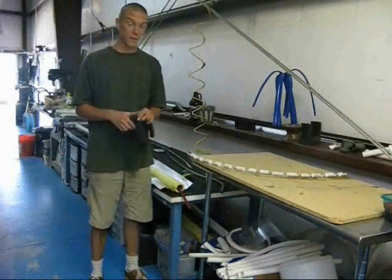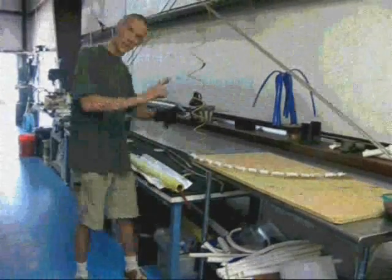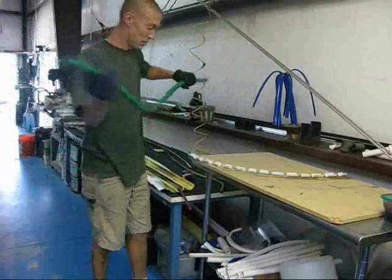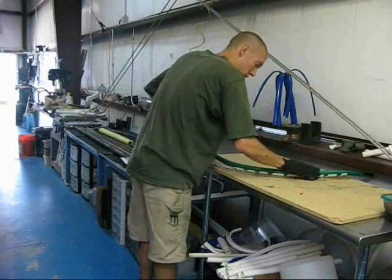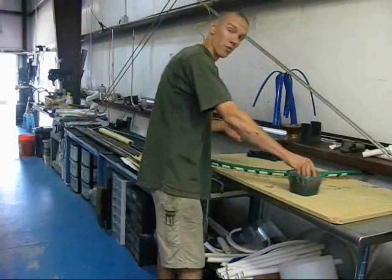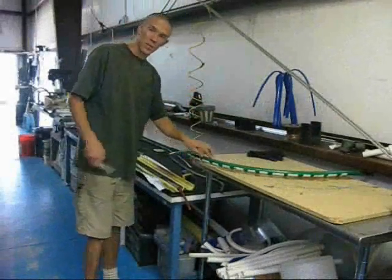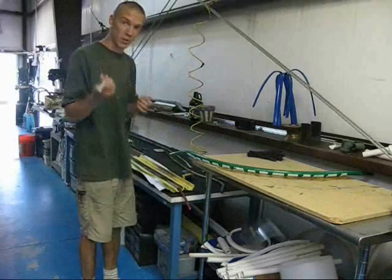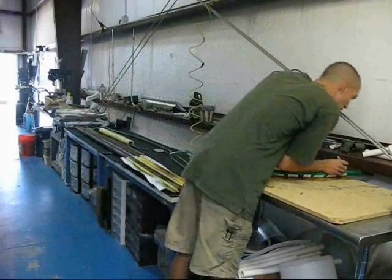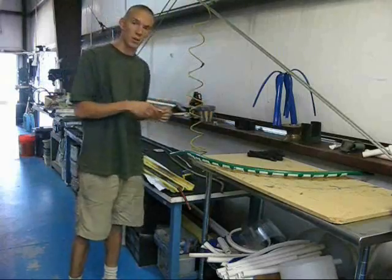It's very important to put your gloves on before you take the pipe off the bender. Take it off — it's really soft. Drop it into the form, then take a wet sponge and run it over the pipe to cool it. Once it's cooled, it's now fully hard. Mark it for cutting on the lines, and it will produce a perfect 90-degree arc at the size you're looking for.